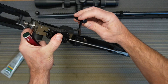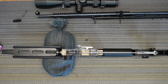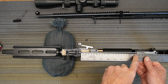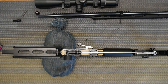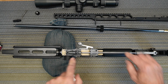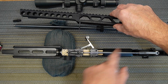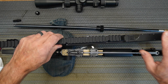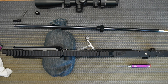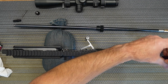Put the spring back inside. Now it catches — perfect. Always check your reloading bar — it needs to be at 210 millimeters; if it's not, you're in trouble. Make sure you're well lubricated at all points because all of this is sliding inside the channels. If you're not subscribed to this channel, please click that subscribe button — it literally costs you zero and it helps me a lot.